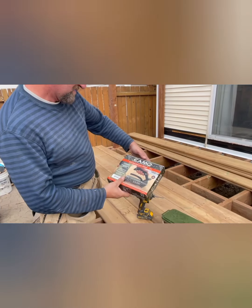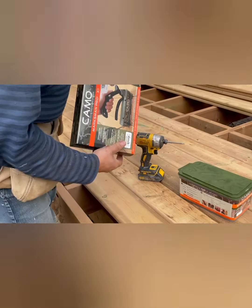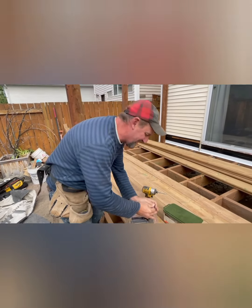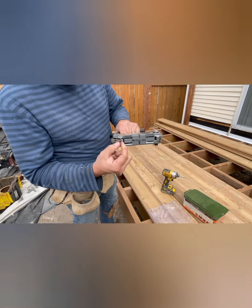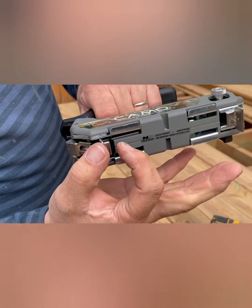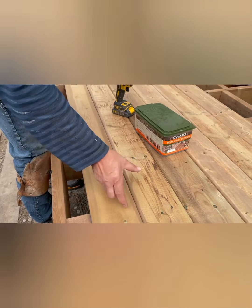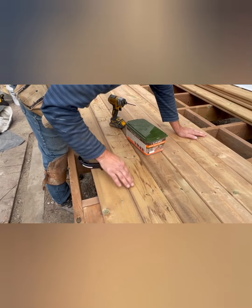This claims 1/16 — this is the Marksman Pro X1. It's barefoot approved, even better. The big difference here is now our spacers are 1/16th instead of 3/16, so just a little bit smaller. That is helpful because when our wood is green it's going to shrink, so we'll probably end up with a 3/16 space. We start with a smaller gap and when it shrinks it's going to work nicely. Right now we have the decking all tight, which is not going to work at all.